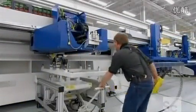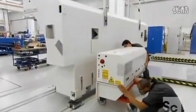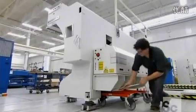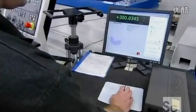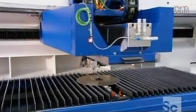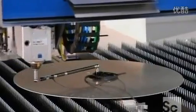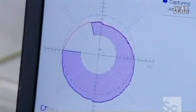They bolt the motion unit to the front of the machine, and the housing that contains the laser resonator to the back of the machine. The resonator creates the laser beam, and mirrors deliver it to the motion unit's cutting head. Lenses inside the head focus the beam on the metal underneath. They run a series of tests to ensure the machine cuts with ultimate precision — it all boils down to whether the motion unit moves accurately, which means the drive system racks must be perfectly aligned.